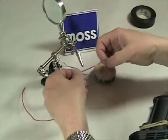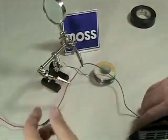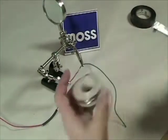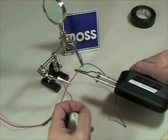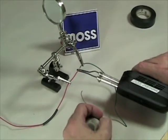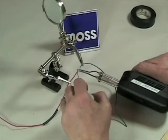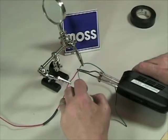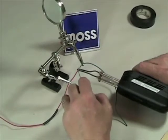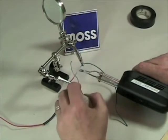Now I'm going to set them just so they'll stay up in the air so I can show you. I take my soldering iron and put it just under the joint where I've got my two pieces of twisted wire, and I'm going to give that just a few moments for some of the heat to start to come up. Then I'm going to touch the solder on here very gently, and the joint will absorb it, as it just did.